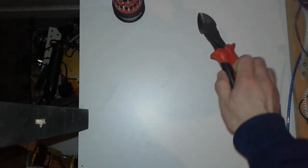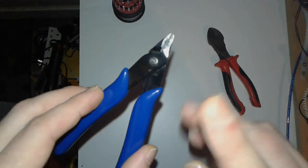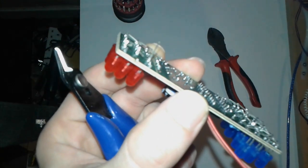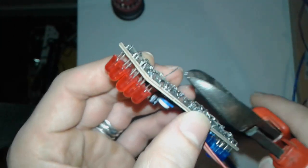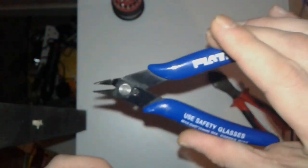When you are working with wires, you're going to need some kind of plier cutter strong enough to cut the wires. Also, if you are doing DIY — a homemade electronic diagram for beginners — you're going to need one of these pointy sharp pliers for cutting the excess of soldering. Like in this example here, you see this pin, this big stuff pointing over here. This one is going to be kind of big and bulky to cut it, but with this one I can go all the way to the end. So this is for the finest projects — not mandatory, but optional and good to have, and they're cheap enough.